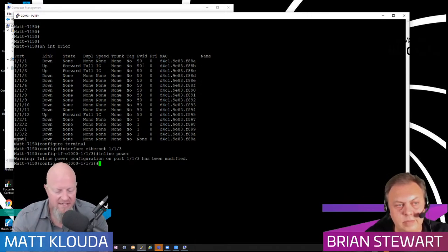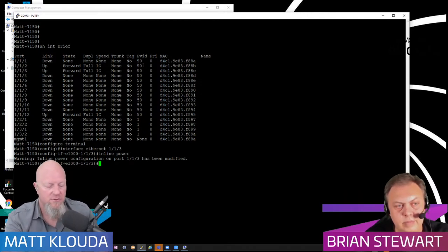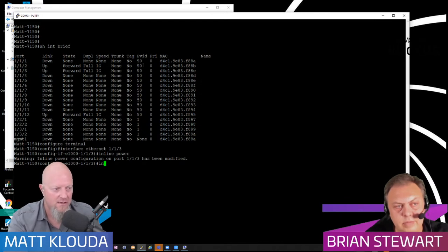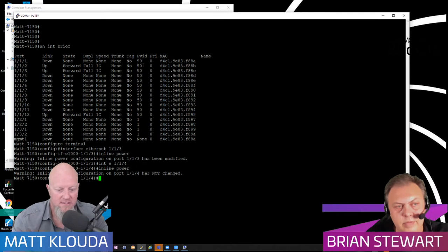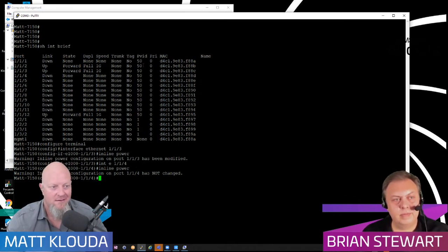So technically, every single port that you have in your ICX, you can turn power on them. So if I need to turn it on another port, I would now do, and you can abbreviate, interface E 1/1/4. Okay. Inline power. It's on. Now, the thing you have to keep in mind with this is, let's say I have my laptop or a PC tower, whatever it is, and I plug the PC into that port that's providing power. What happens? Nothing. It doesn't start shooting power into your device because it's not asking for power. So the switch itself, it won't hurt it. You can turn power on all those ports and make sure that they're up and running.